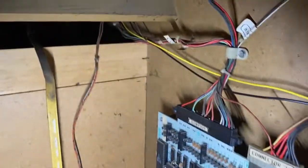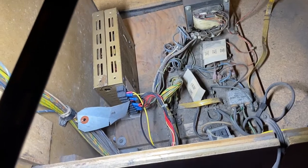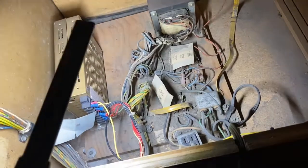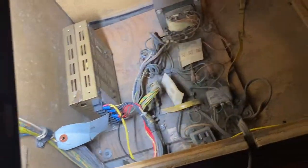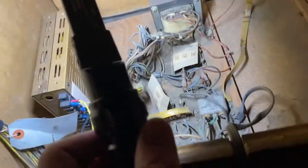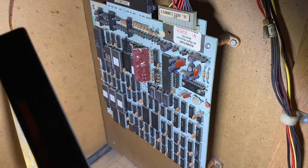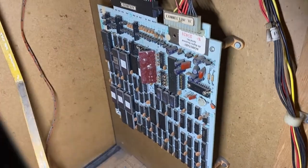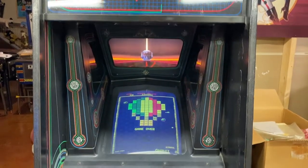I've got a bundle of wires going forward to the controls — I'll see where those are spliced in. The yellow and black are the power I ran; I can always rerun those. That means it's 12 volts. You can see the blade power supply that was put in here and the original power brick — somebody just took AC from the transformer and ran it to that unit. I'm going to make sure that's on the proper side of the transformer — the non-isolated side, not the monitor side of the isolation transformer. I'll check with an ohmmeter. You can see that's not a JAMA plug — you've got your power connector and your controls with cut wires.